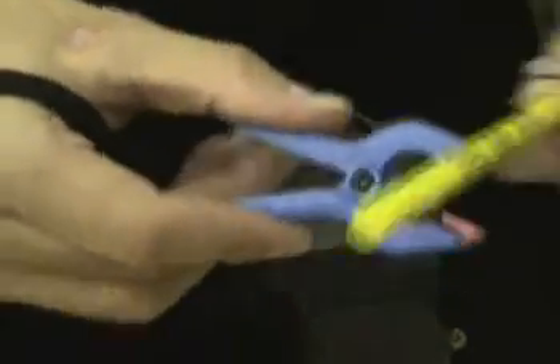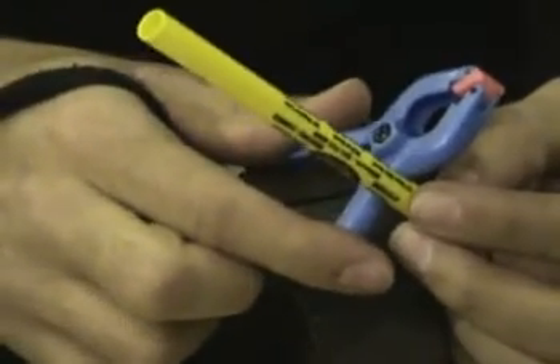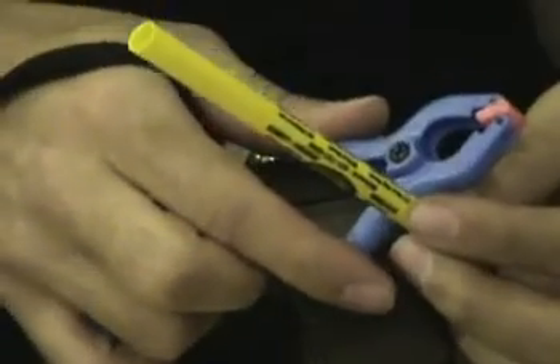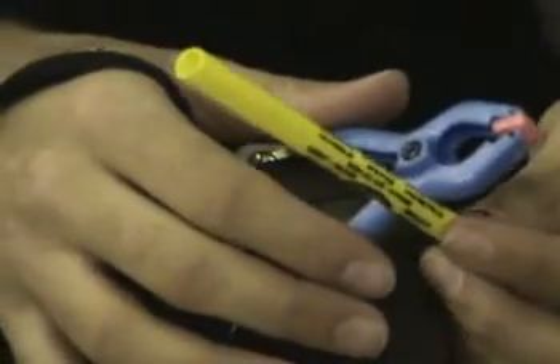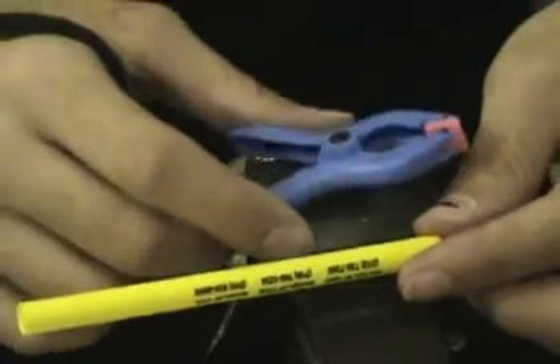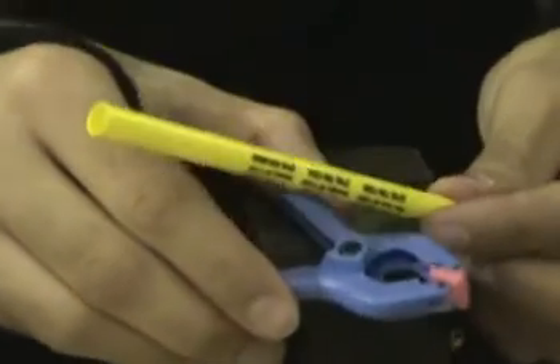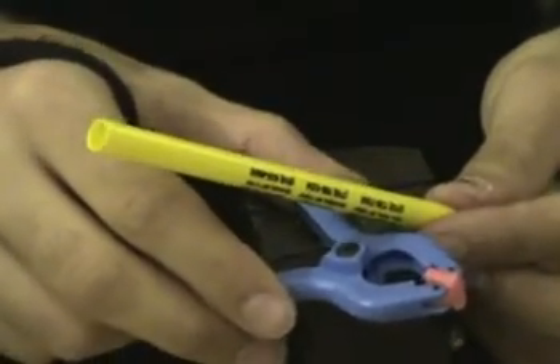And if you can get to the hardware store, you can go and get these little itty-bitty clamps. Now you can actually go around, glue your dipole, and have a clamp-on dipole. So if you take mass transit a lot or are in a car a lot — when you're inside a car or a train, they're made out of metal. As we all know from earlier segments, metal will reflect radio waves. So if you're inside a metal car or a metal train, your radio signal can't get outside. By taking this and just clipping it outside, you have an antenna outside and can propagate your signal a little bit better.